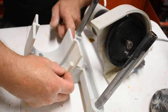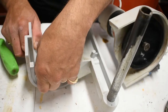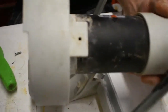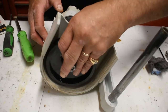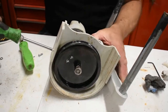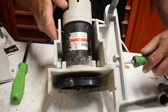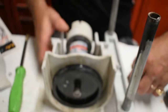Normally you would not have to take the motor out, but with everything we did that was a lot easier to do. We're going to put our bushings back into place. The spring fits down in there, and then you can see the screws are going to go back in there. It fits right back in — very easy to assemble and disassemble. Essentially it's just the bushings; the screws go through there and hold this whole assembly together.